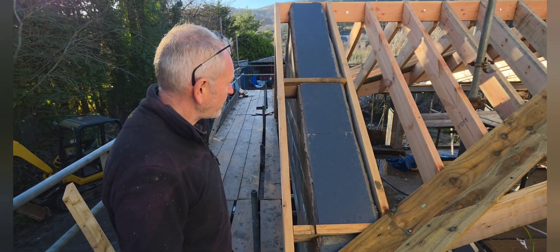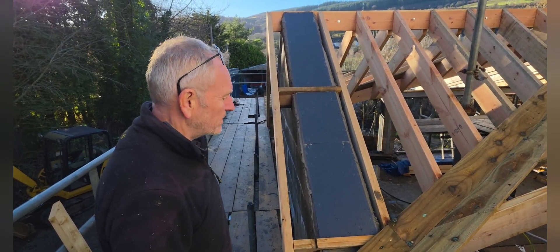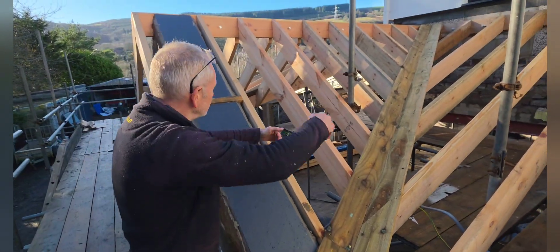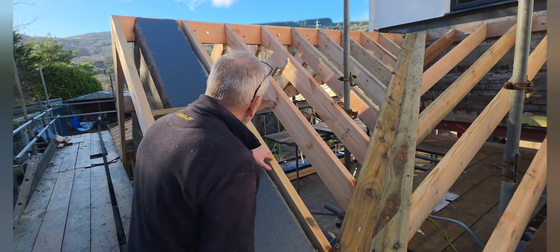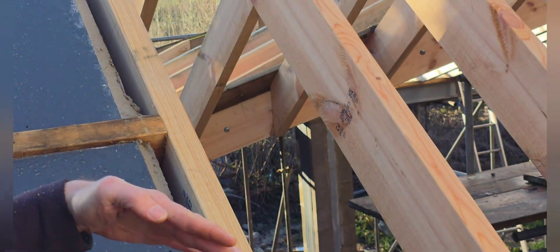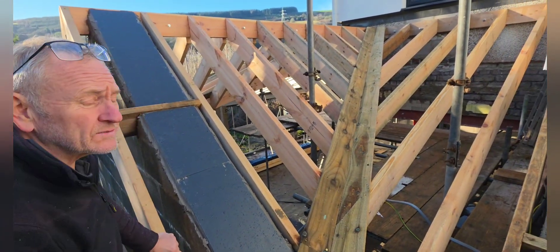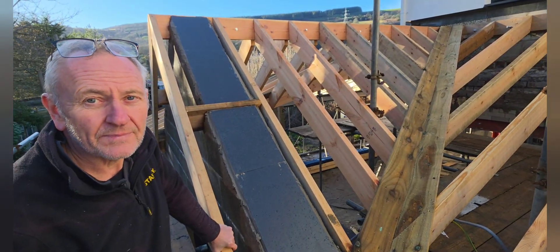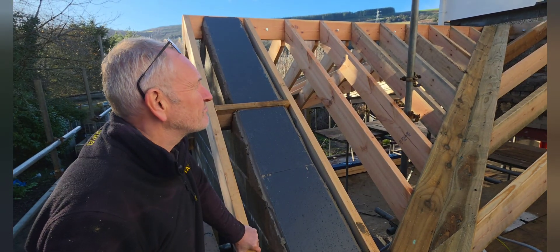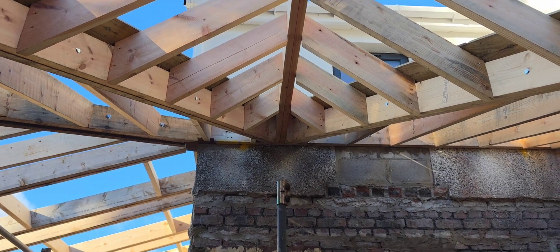What were the key points for this gable you put up? It's just very difficult — a lot of thinking. You've got your valleys which are floating, so you've got cuts coming down — you can't see now because of the boards, but every cut is different. You've got that cut coming down plumb, then the rate going up. A lot of thinking, a lot of cutting by hand because they were so tight I couldn't get my saw in. But we got there in the end.